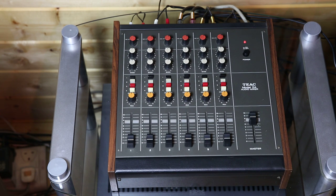There are six audio inputs, either line or microphone for each, switchable. There's also a third setting which is an attenuated microphone input if you have a very high output mic. They're all quarter-inch jack unbalanced inputs. At the moment I have all six inputs switched to line. On each input channel there is a bass and treble control with plus or minus 10 dB, which is quite significant.